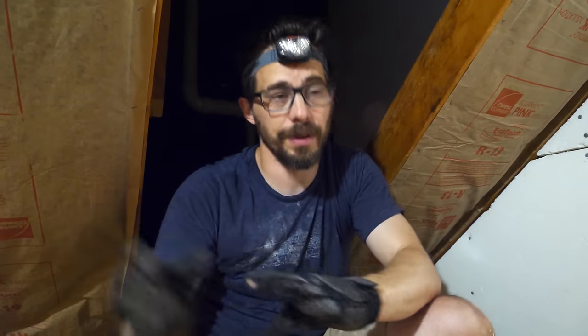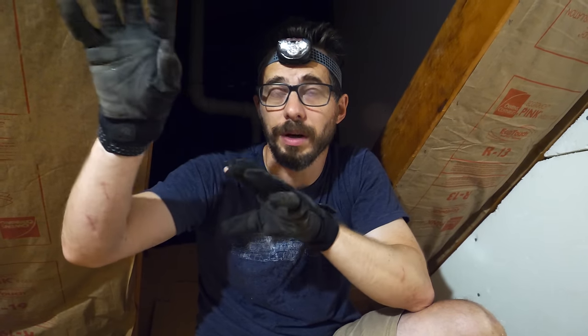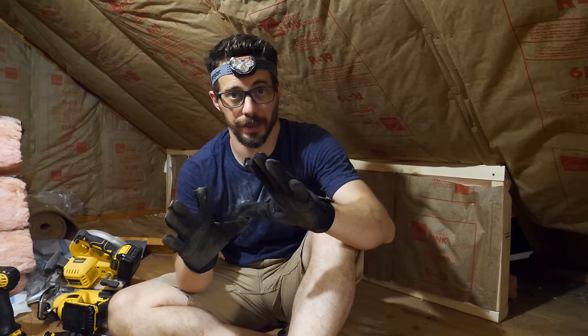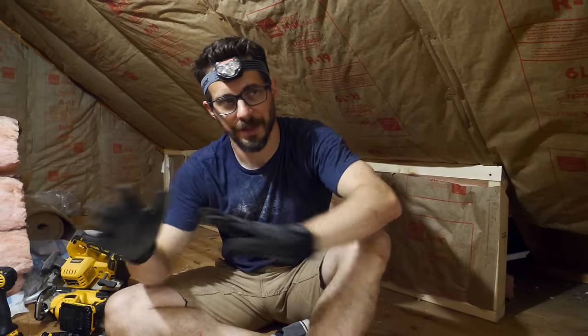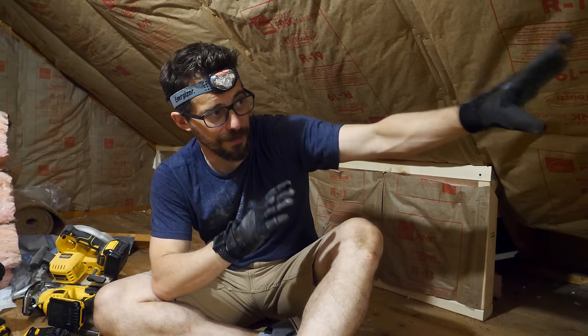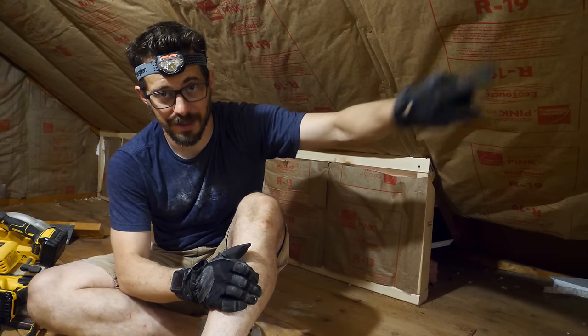I did have to move some electrical around — it's all out of the opening now. I also had to move an air conditioning vent up to where you can't really even see it, but it still goes into the other room. We're going to leave the grate where it was to keep a little bit of airflow and equalize the temperature. I've got the rest of the insulation up, and this gap right here is going to be our access door to get into the rest of the attic. The plan has changed just a little bit — originally this was going to be a separate room from the closet with a wall and a door between them, but now it makes more sense to just leave the whole thing as one big space. That means we have to build another knee wall to extend this all the way across, and then work on the attic access.